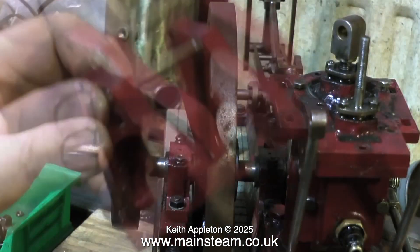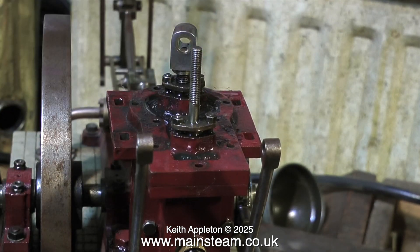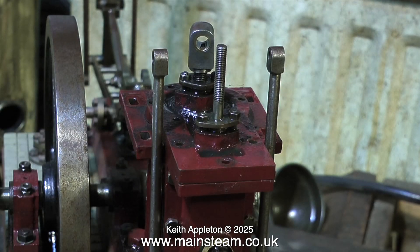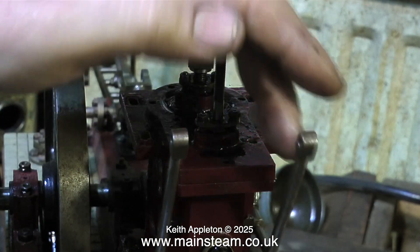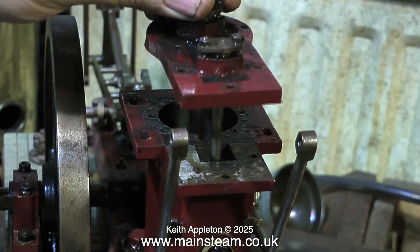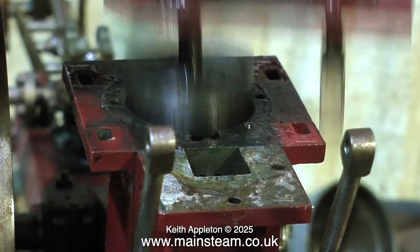It's time to try and remove the cylinder head. An easy way to do it is to move the piston up and down quickly, but in this case it didn't work. So the next thing to do is to very carefully, putting a minimum of pressure on, use a sharp knife, tap it with a hammer, and it will break the seal. After which, on this engine, you can remove the piston and the valve in one operation.